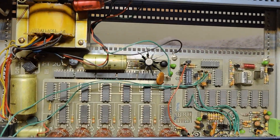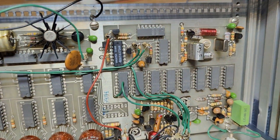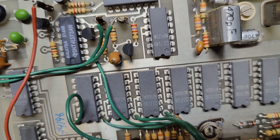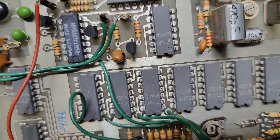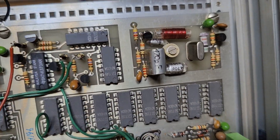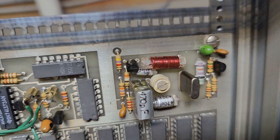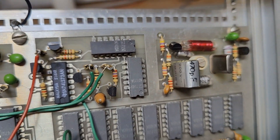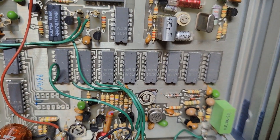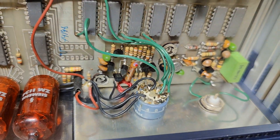Inside there is one big circuit board with a lot of TTL ICs, and I believe that is 1971. That will be all the time-based dividers, and the clock oscillator — a crystal oscillator. The different outputs from the time-base go, of course, to the time-base switch to select the different timings.